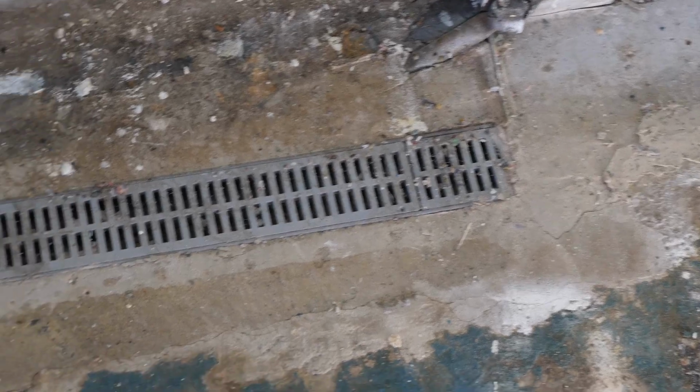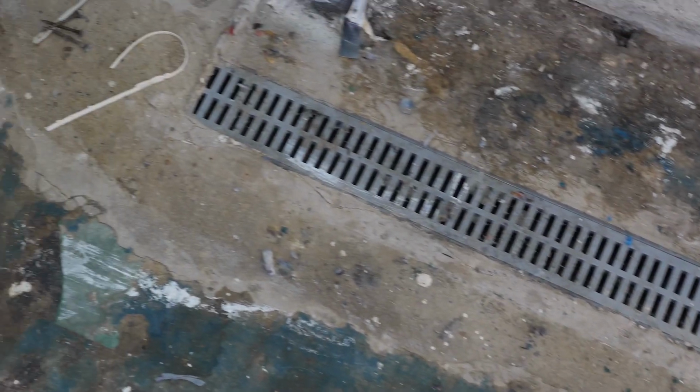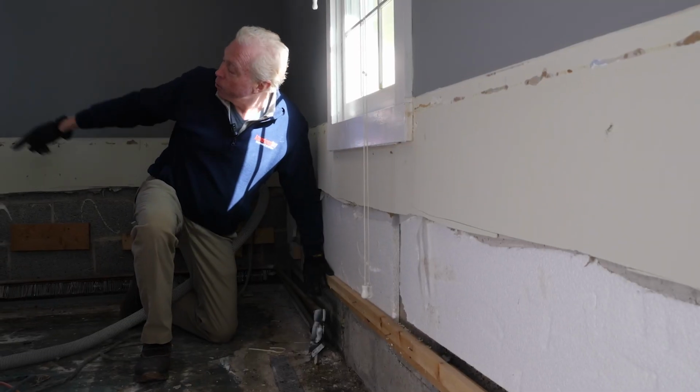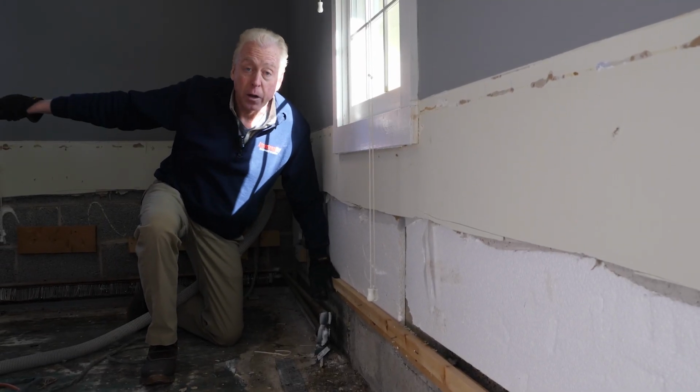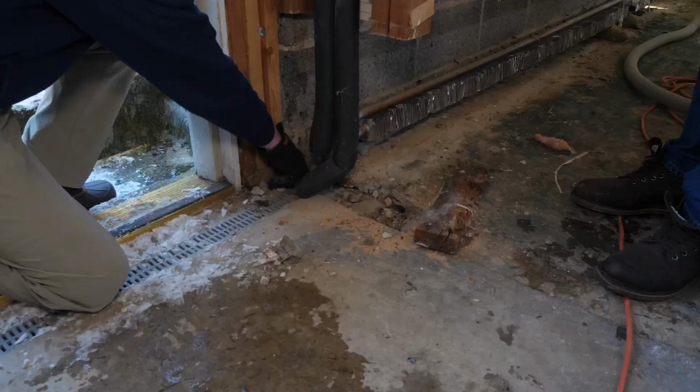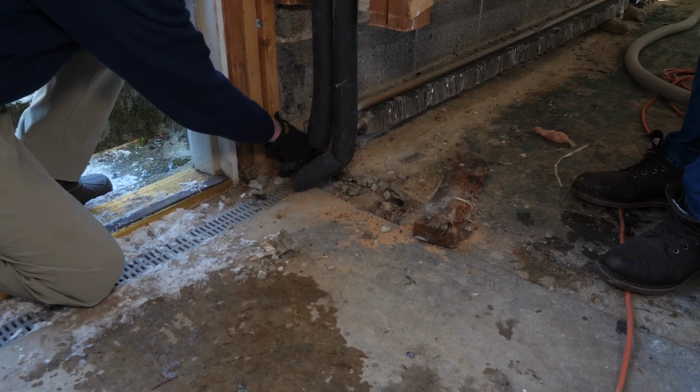You're going to see it has to work its way by itself, get all the way over to here, do another right angle, work its way this way and around this wall. And then there's another grate over here that has the same type of setup where it's not a continuous system, get through that and work its way over to the pump. And it's going to be very clear as we tear the system out just what you don't want to do when you're